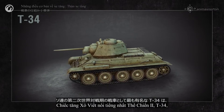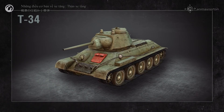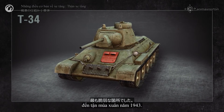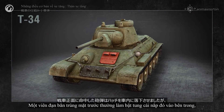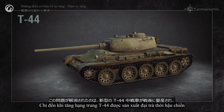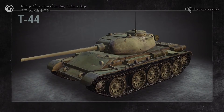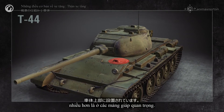The most famous Soviet World War II tank, the T-34, had a large driver's hatch in the front glacis plate. It was one of the most vulnerable points of the early models of the T-34 up until the spring of 1943. A shell hit to the front usually hammered the hatch into the interior of the tank, where the driver was located. It was not until the new T-44 medium tank came into mass production after the war that this Achilles heel was eliminated. Later, Soviet tanks had the driver's hatches on top of the hull, rather than in the glacis.